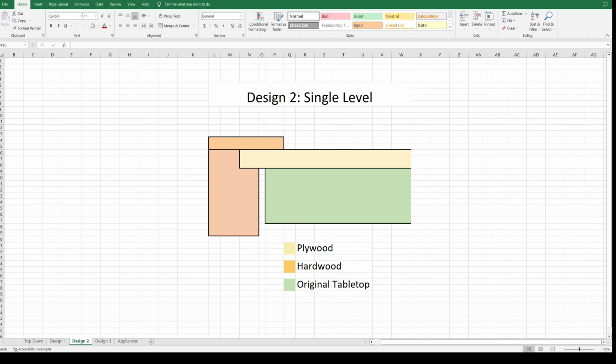But in the single level table, all you're doing is this is your side pieces for the table, for the box that you're making, except there won't be a box, there won't be any top, and there'll be very little in the way of sides. And then this is your armrest, essentially. You glue those together, you mill out what in this case we'd call a rabbet rather than a dado, but it's the same idea. And you can attach it to the table.